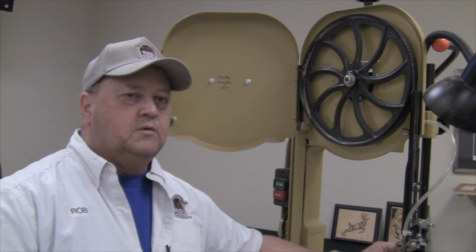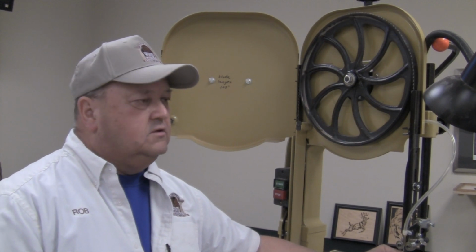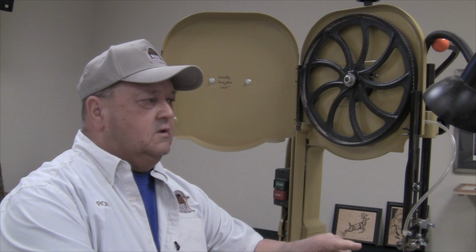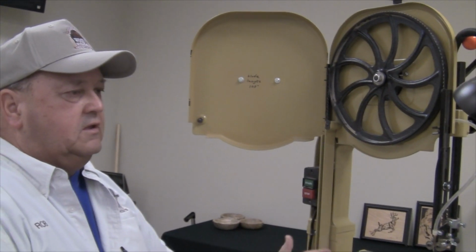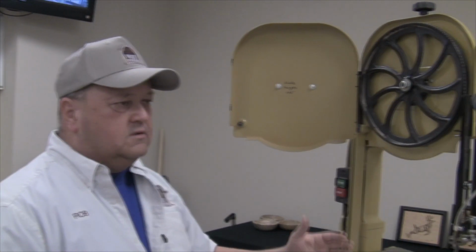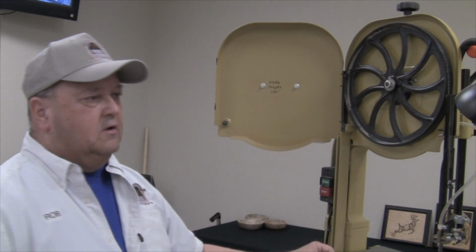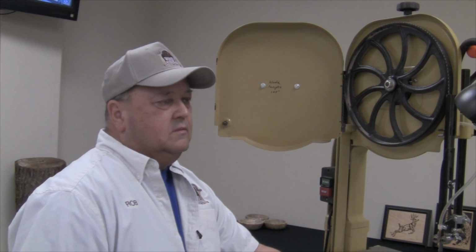Now, I went over to Jim Cummins-Weiler's. He has a bandsaw that he uses for resawing, and I think the blade is 3 inches. It's so long and tight, it's just perfectly dead-on accurate. So if I'm doing a lot of resawing, several things, not just a board or two, we go over to his house. Yeah, it works great. Once you twist that blade, even the slicer, it no longer tracks.